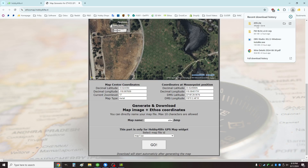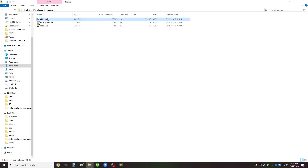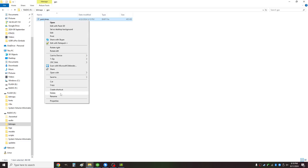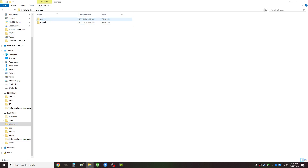This downloaded a new file called eldo.zip, which I'll open. Inside is eldo.bmp, an instructions.txt, and a map1.lua file. You can ignore the Lua file — the two files you need are eldo.bmp and instructions.txt. For eldo.bmp, you need to copy it to your radio under bitmaps/gps. There's probably a default paris.bmp there — I delete that one since I never use it — then move eldo.bmp into bitmaps/gps. You want your map file to be under bitmaps/gps.